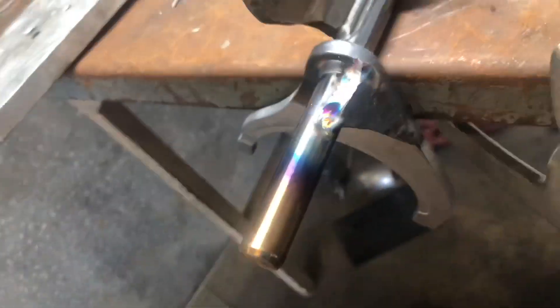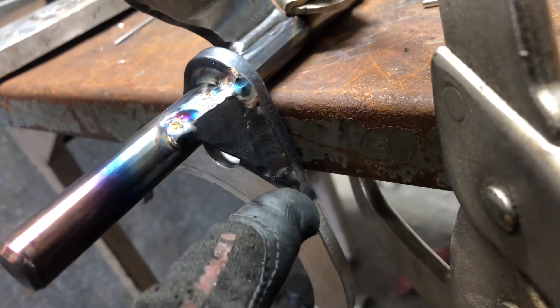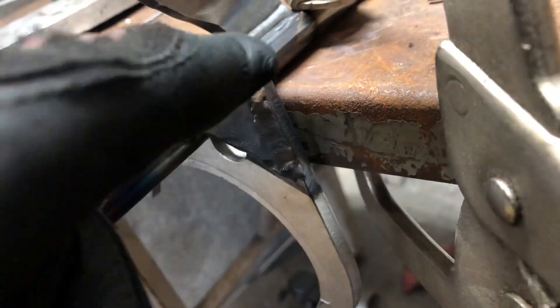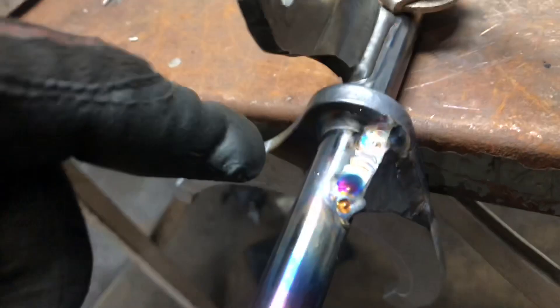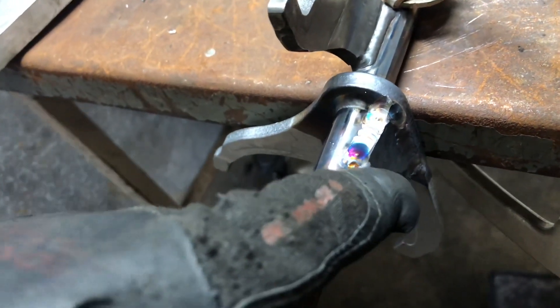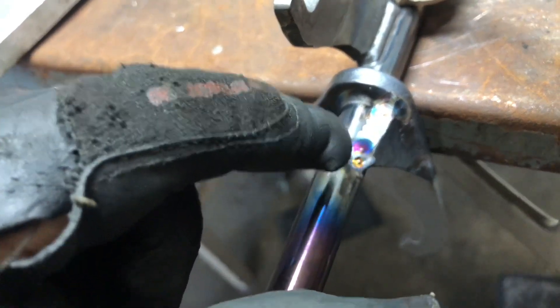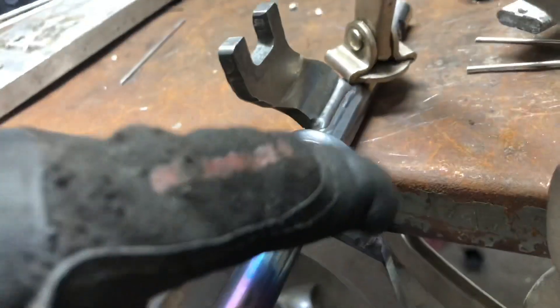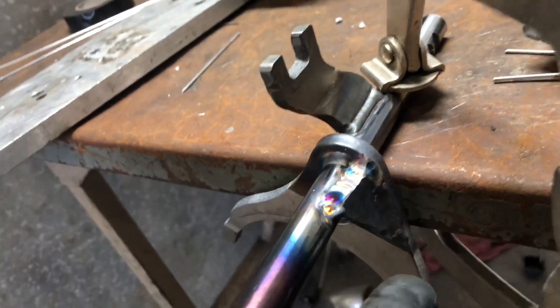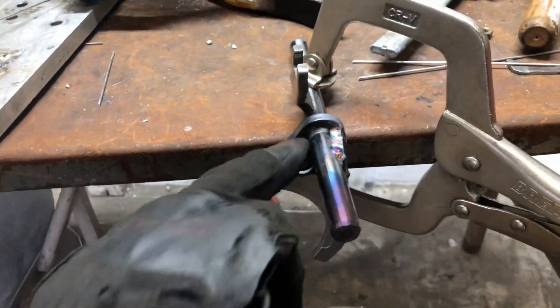About 10 minutes of work and I got the gusset welded on. I kind of want to touch over right here again — Ricky was saying it was too hot right there and not hot enough there. I feel like I got a better middle ground right there. That was where I originally tacked it on and then went over it a bit; I didn't really add any filler there, just tried to bridge it with the heat. I'm going to go over that part again, but besides that it should be pretty good to move on to the other side.